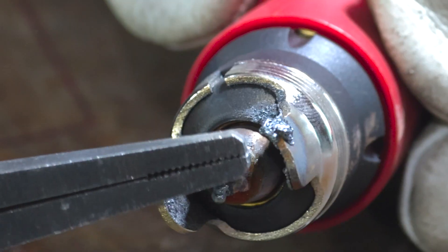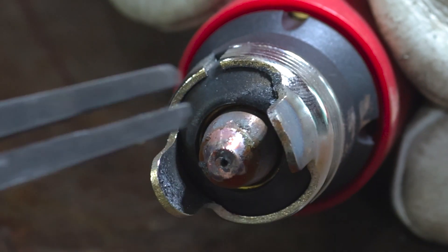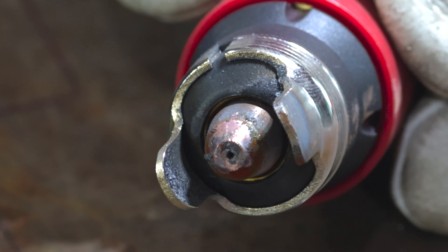This is one of the common issues when you try to pierce a hole like this. That little slag does just kind of flake off, but that can burn up your tip pretty quickly.